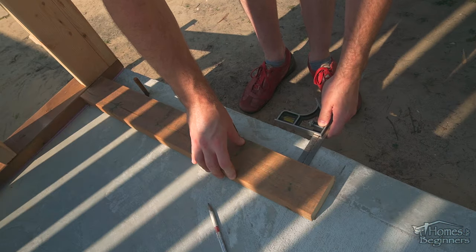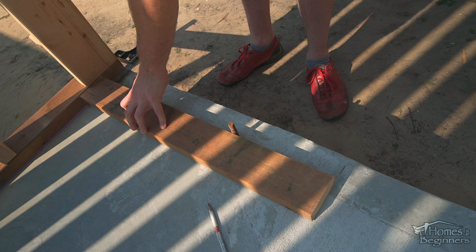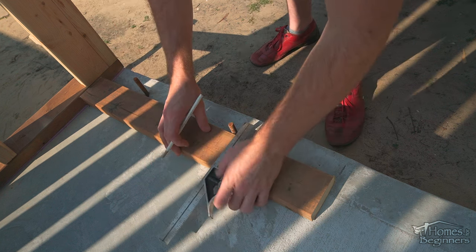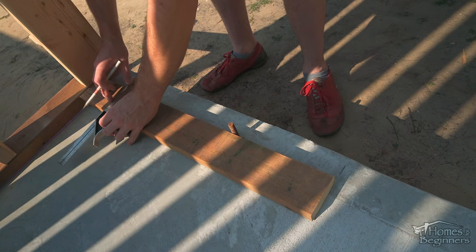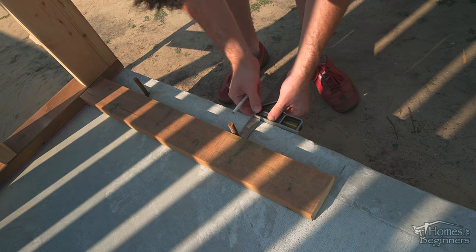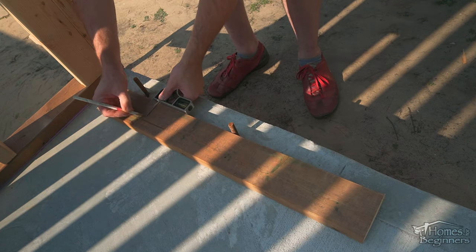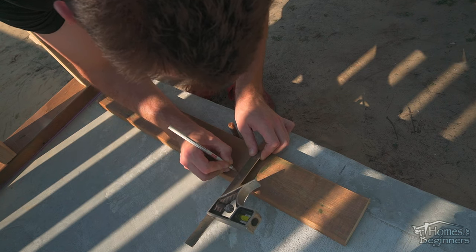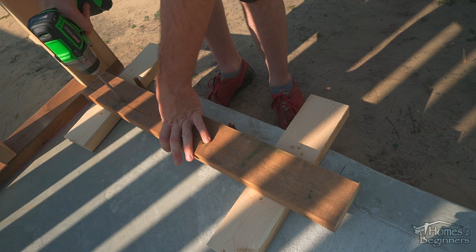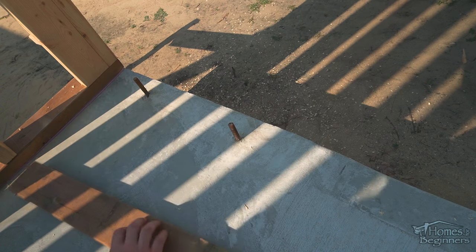Now for a close-up of the same process, this time perpendicular to an exterior wall instead of working on the edge of the pad. Again the board runs parallel with the edge of the pad — if it's on an angle it may throw the position off for the marks of the bolts. Next is marking out the edges of the anchor bolts using the combination square, then setting the depth for each bolt and transferring them over to the plate, then marking out the center points for drilling. The holes are then drilled with the appropriate size and, when done, as you can see it's a perfect fit.